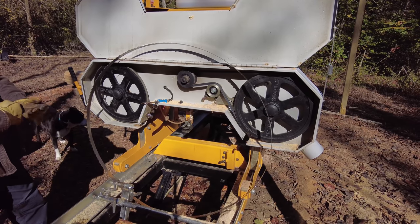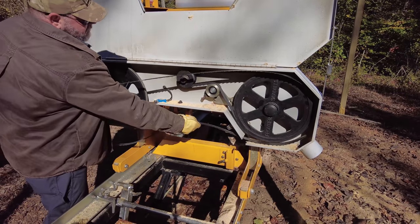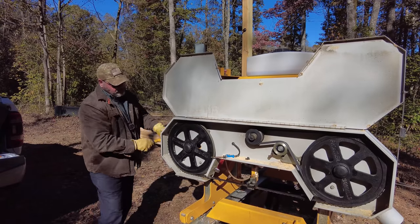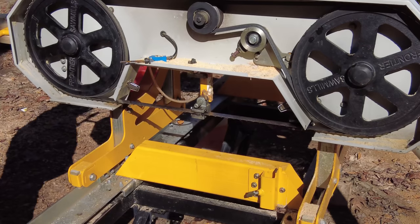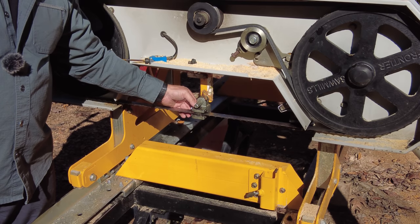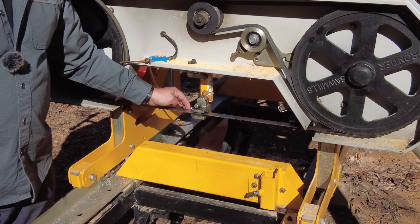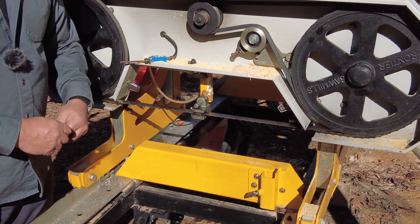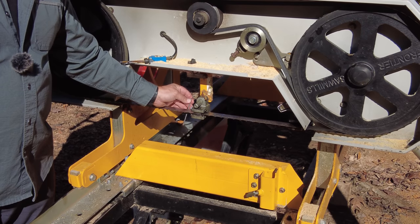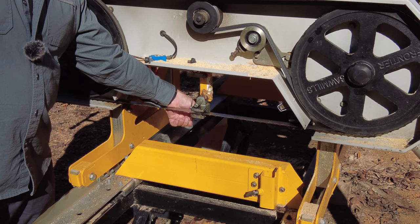I did not tighten it back up yesterday because I was looking at something. I'm backing the wheel all the way off to the neutral position — there's no tension on that spring at all. This is a brand new Frontier blade right out of the box and we'll go ahead and make sure it's tracking correctly. What I want to do now is just pull this blade guide out so that blade guide wheel just barely grazes the back of it — maybe a half a sheet of paper between the wheel. This is my own opinion; I think the book calls for a little bit more space. I'm having trouble with it staying on, so I'm going to go a little bit tighter. Plus there's a brand new bearing, and I bought a box of bearings, so if this happens again I'm going to be ready.